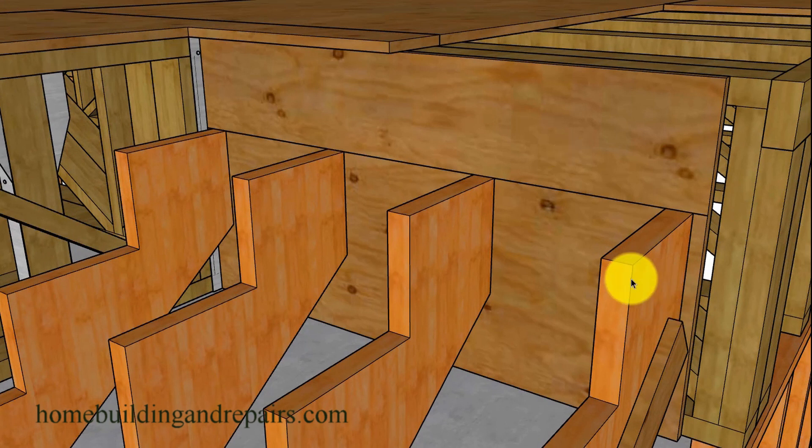At the top, you could toenail with two nails on each side, or go to the back and put a couple of nails in from the back of the plywood. Or you could always use a ledger. If you get our stair book, I recommend getting the double stair book package for the straight set of stairs — it provides different methods for laying out the top of the stair stringer and the bottom where it connects to either the upper floor or the lower floor.